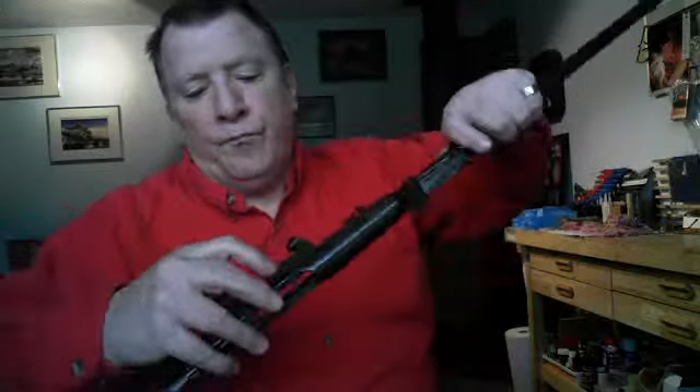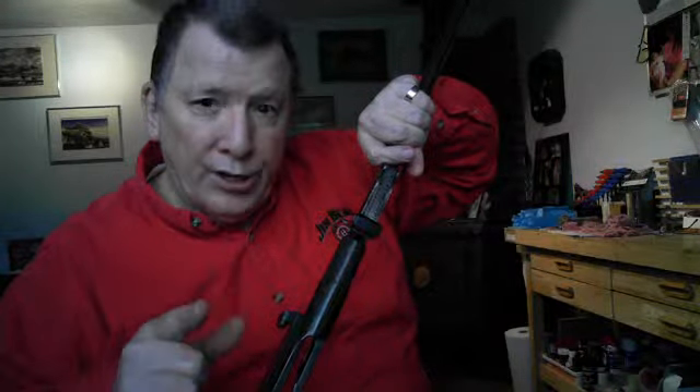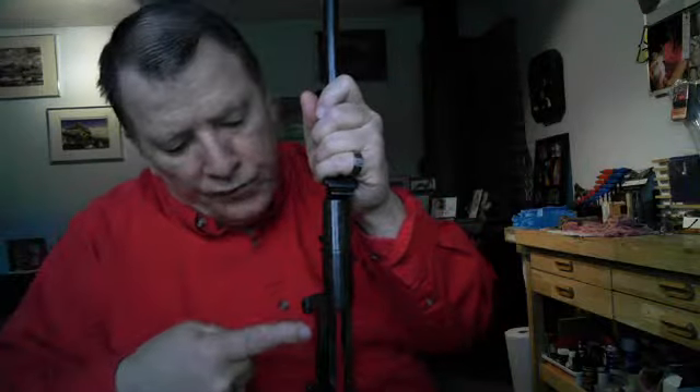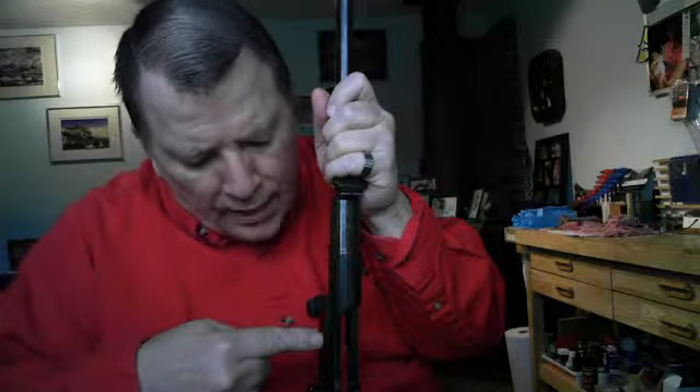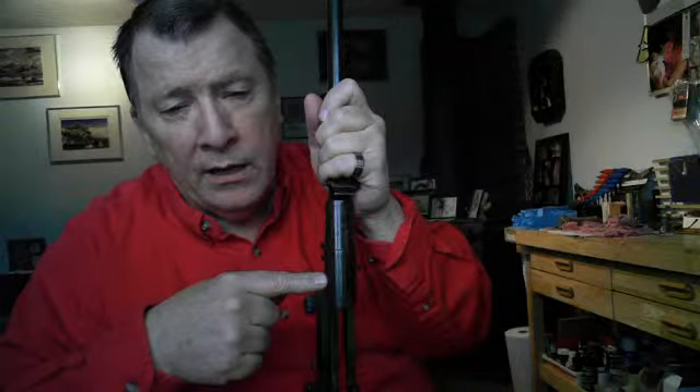The final drill is the important one. You want to set it on your bench and use the hand drill, keeping it as straight up and down as possible — it doesn't have to be exact to the degree. Once you've drilled through to the size of the screw, the screw won't go through yet because it needs threads. Now you're going to tap it, going from the outside to the inside, and this is where the difference is — as long as you keep it reasonably straight both ways, and start tapping.